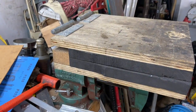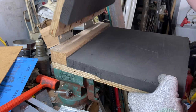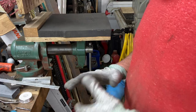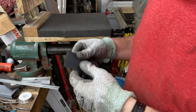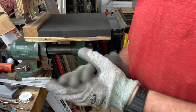I'm going to change my camera angle to my kydex press. This normally needs to happen relatively quickly — it starts cooling off immediately. The hotter you are when you take it out of the oven, the more formable the kydex is going to be and the more definition you'll get. When you take it out you almost want a wet leather consistency, just real nice and flexible. Feel around for any potential hot spots or cold spots — if you don't leave it in long enough you'll be able to feel where it's already started hardening up.